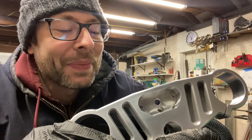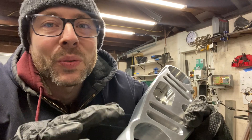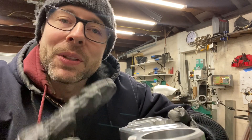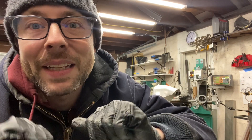I just hit that point where you have to stop messing with it. We got all the really bad mistakes out with the die grinder and the Scotch-Brite wheel, hit it with some hand sanding, then a little Scotch-Brite and some super fine steel wool, and I got this nice dull aluminum luster that I was after. This part's looking really good. I've got to move on to some other parts on this bike to try to finish it up. I'm going to be filming segments as I go and posting them here, so if you like what you see, please subscribe and I'll catch you next time. Thanks for watching.